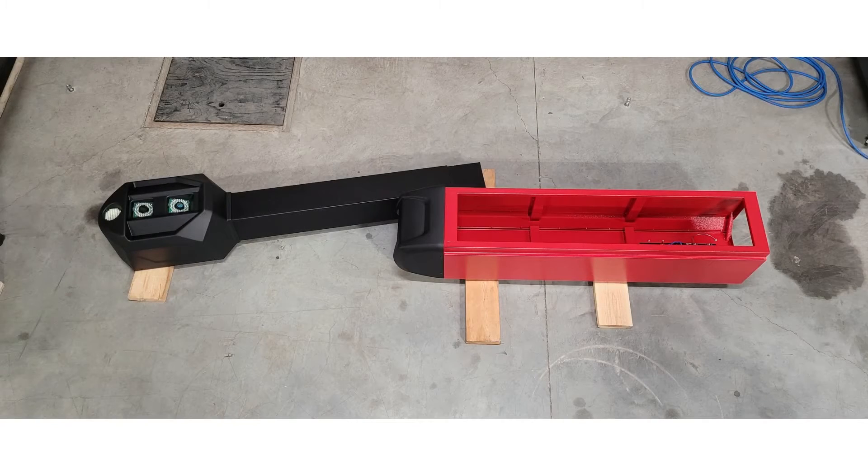After opening shipping crates, remove the front cover from each tower and remove components shipped inside the towers. Lift each tower out and place them sideways across the top of several wooden blocks. Please note that each aligner is installed and tested before shipping to ensure quality control. As such, certain areas may have slight signs of being previously assembled.